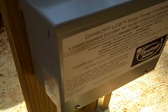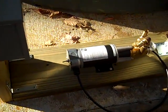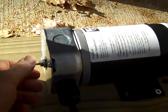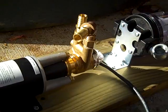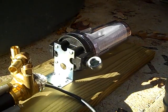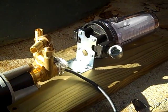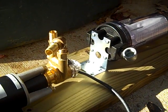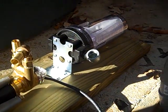We'll be wiring into the LCB — that's the linear current booster. I've added a simple toggle switch down here so if you need to do any maintenance you can shut the thing off without having to open this up and flip a breaker. I'm just trying to figure out how I'm going to orient everything and plumb this and insulate it. Insulation will be key here. They're going to be insulating this building and the thermal mass from this tank should keep it warm enough to prevent the lines inside the building from freezing.